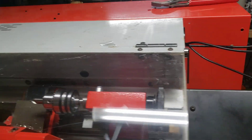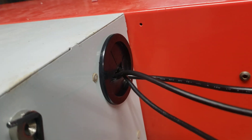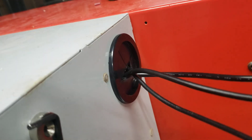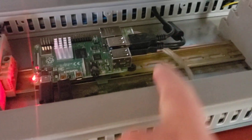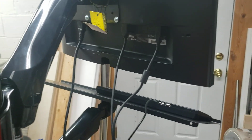In doing that, I also found these rubber grommets that take the place of the plastic plugs that come with the machine for various accessories. I'll do a walk around here — it's a rubber grommet that takes all the cabling. I can run it inside of there. I'm running it through the factory gland plate and then into the cable channels and then to the Raspberry Pi. I can clean this up a little bit — got my ethernet cable coming this way, and the USB cables going that way. They go through the gland, come out of the grommet, and go up to the monitor.